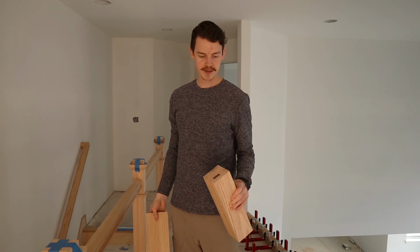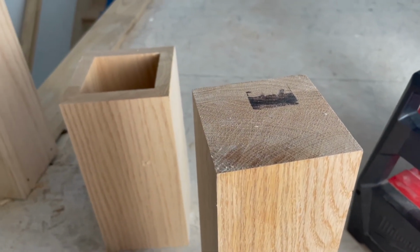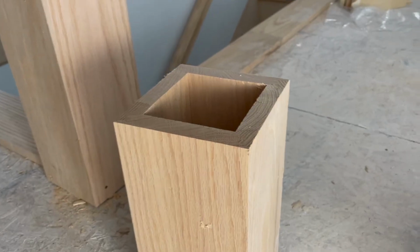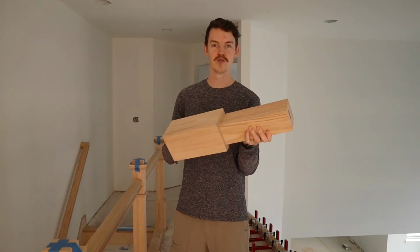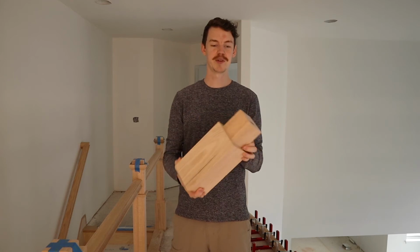For those of you curious a little bit more about what these Newel posts are made out of, you can see here is our solid engineered oak. It's actually 4 3/4 inch slices put together and glued from the factory with no gaps. And then this is a very handy outside trim piece. This slides right around it so that we don't have to make these miters in the field, because these do have to be precision pieces. We want this to look perfect. We want to see no flaws, because this is really what shines in this entryway downstairs and this walkway and bridge over from our master bedroom to the other bedrooms in the house.